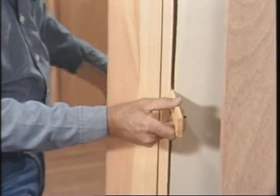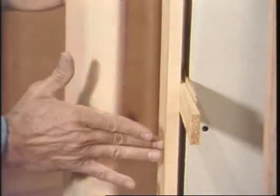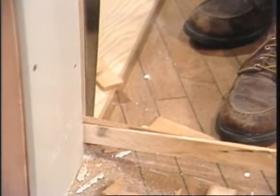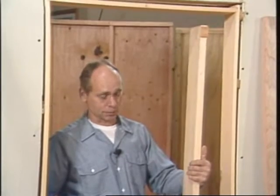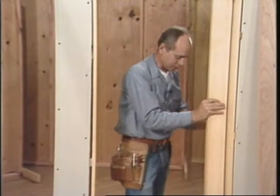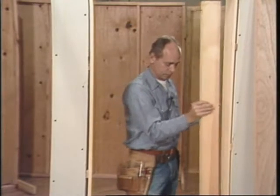The other side is bowed in. I'll hold a straight edge with my knee — that'll free both hands — and then I'll shim it and bring it right to line. Be sure to cut the shims off just below the surface so they'll be out of the way of the trim. If you can't cut them with a sharp utility knife, saw them off with a handsaw. That's how I go about setting an interior jamb. I use a plumb bob because it's fast and accurate, but you could also use a straight edge with parallel sides and a little block on the top and bottom. Just put it against the jamb side, and you can use any size level to check it with.